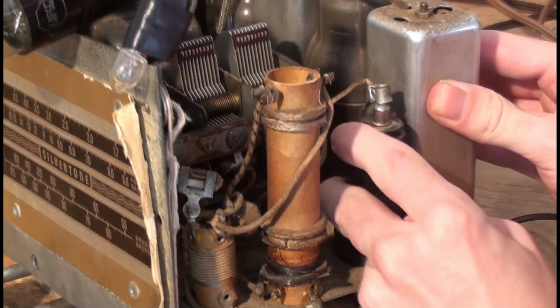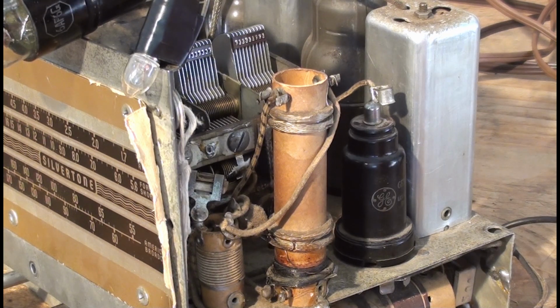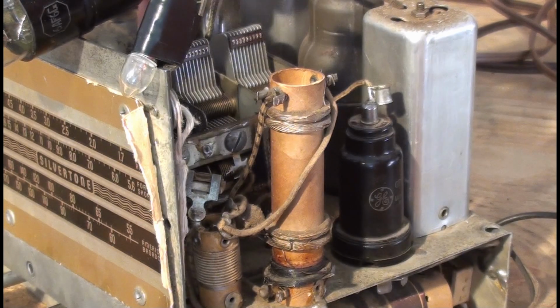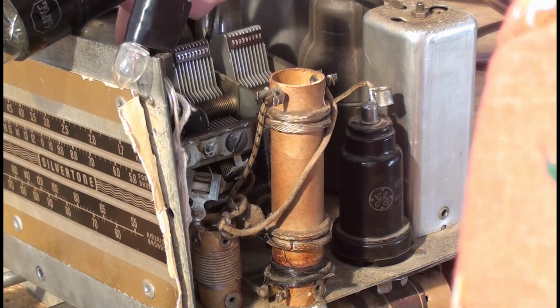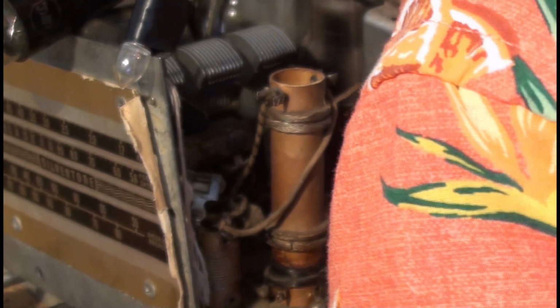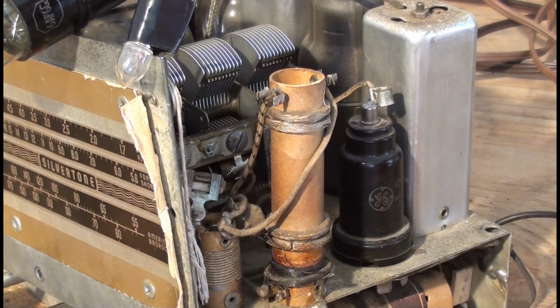These tube sockets are so stiff. Yeah, we did clean the tuning capacitor in the prior video. It didn't help too much, but there's a fin here at the end that's kind of bent, or it's loose, actually. I don't know how that happened. I could bring it so that it's closed here. You can't really see this very well on camera, but is that a little better? I'll show it on camera in a bit here. I gotta swap the oscillator back out.